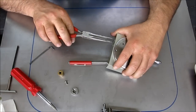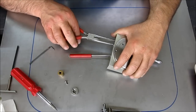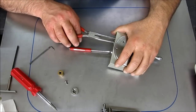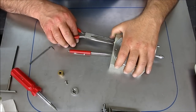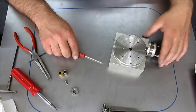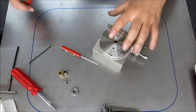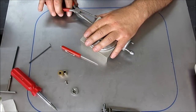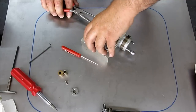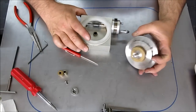And then there's another little bushing in here that has to come out — I'll just reach in there and get that. This is just a spacer. A little spacer there. Now we can actually take the table off. The way we do that is we actually just kind of deflect the shaft sideways to disengage the worm. There it goes, and then that comes out.